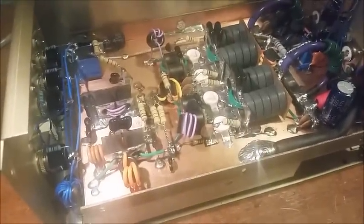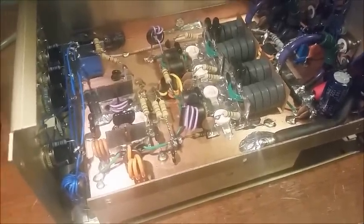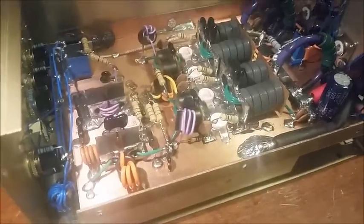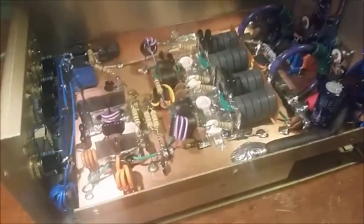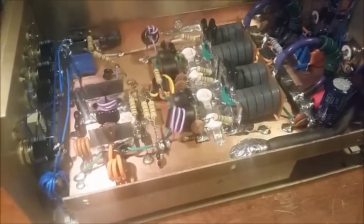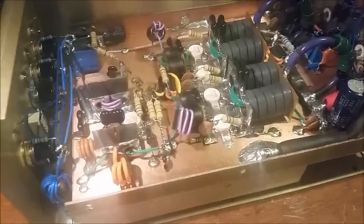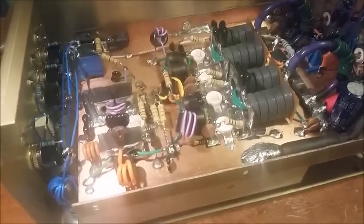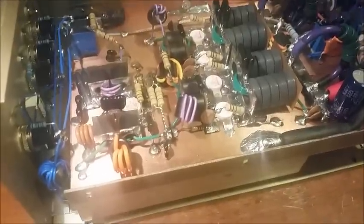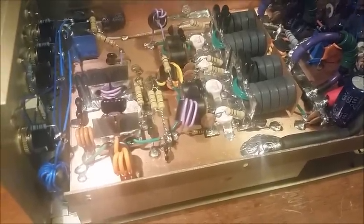As a lot of y'all probably other techs know, and other people that's done a lot of extensive wiring like this, when you're dealing with multiple relays, you can deal with weird, mysterious backfeeding. Pardon the pun. That's what I like to call it. It's wild how DC can flow mysteriously sometimes. I won't get deeply into it, but sometimes you have to control things with diodes. Sometimes you have to shunt things to ground. Sometimes you have to reroute things differently, add resistors here differently.